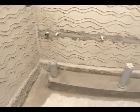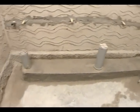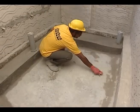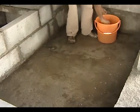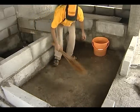In case of sunken slabs, bathroom floors and water tanks, all works like grooving, piping, chipping and patchworks should be completed before application. The surface should be cleaned thoroughly to remove all loosely adhered material and washed with clean potable water so as to remove dust. The surface should be free from oil, grease and algae.